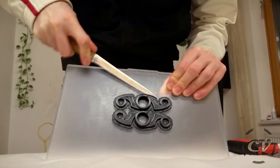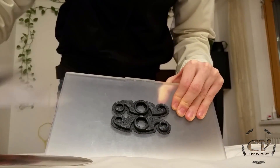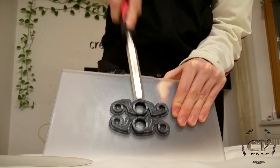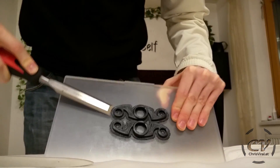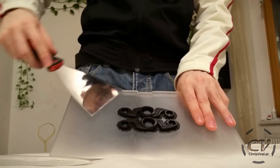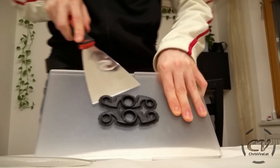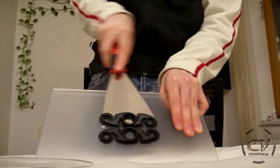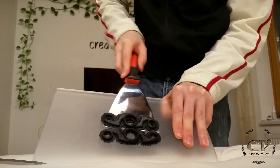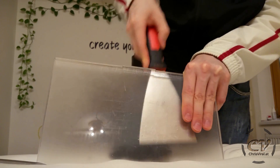It is just a big angle right there, and it's a pain. You could also do it with the thick scraper, but it's not as sharp as this tool, so it works way better with this one. You can also angle it a bit and just poke it loose. Now we have loose edges right there, as you can see, and right there it's still connected to the print bed. Now we use the big tool, and just go underneath and wiggle it off. It's really easy actually, it doesn't take much force. It's pretty much convenient with this — previously with just the knife, it was a pain. But now it's convenient.